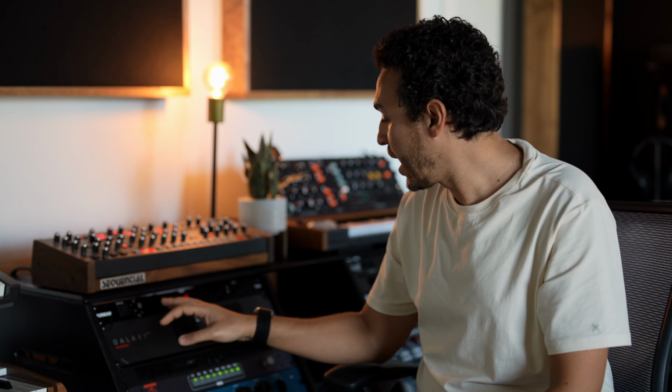Also, I used to connect to my Behringer P16 for in-ear mixes for the live room out there. I used to go ADAT to this unit and convert inside the Behringer, which is not the greatest quality. But now that I have more IOs on this, I switched my setup and went analog out from this into my Behringer P16. 2 DB25s, each carries 8 channels of audio, so I'm sending 16 channels to the Behringer, and that feeds the personal units in my live room, and I can drag and drop from the control panel what I'm sending in those 16 for custom mixes and stuff like that. So that's one of the first things that I absolutely love about this, the 64 channels of IOs.